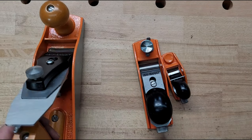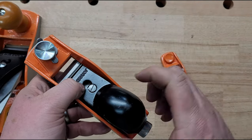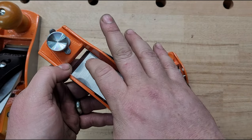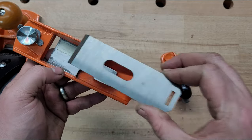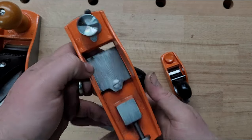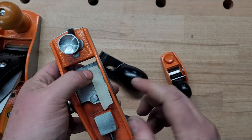For the 60 and a half, I needed to smooth the bottom again and round the corners. In the video you saw me filing and filing — that wasn't actually necessary. What I learned is I just needed a shim. No matter how I adjusted it side to side, it was still digging in deeper on one side, which told me I needed to shim it. I just used one piece of paper. Basically it was high on one side, pushing the blade over so much that it actually chipped out the mouth.